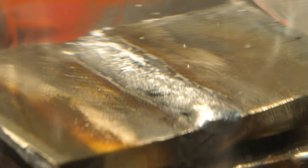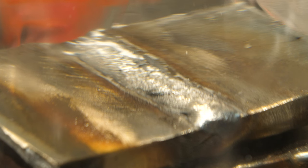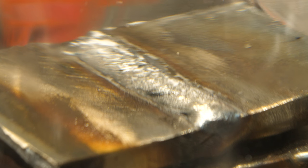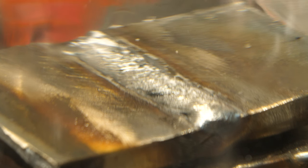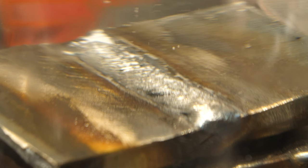It's a little difficult to get a clear video because of the mineral oil distorting the way light passes through it, but you can see all those little bubbles collecting and escaping. This is about as high a hydrogen level as you could really have out of a weld. A normal 6010 is about a quarter of this amount, but it does have a significant amount. A proper 7018 would normally have no bubbles because there's no hydrogen escaping that weld.